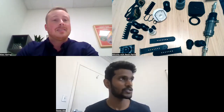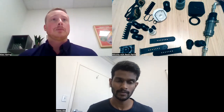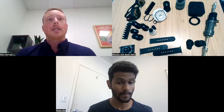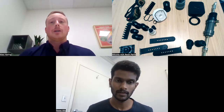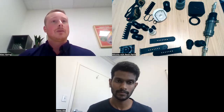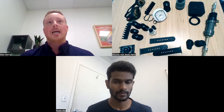Alex, could you also tell us a little bit more about how it compares to other 3D printed elastomers? This is a 100% silicone material, which is unique. Most other 3D printed elastomers on the market, especially in SLA and resin printing, are going to be some sort of a urethane-based material, which is great for some things, but it doesn't have the range of temperature stability or the range of chemical resistance and inertness that we get out of this. A typical elastomer might start to feel a little bit soft and almost gummy rather than rubbery, whereas these silicone materials really feel like you'd expect a rubber piece to feel and snap right back into place.